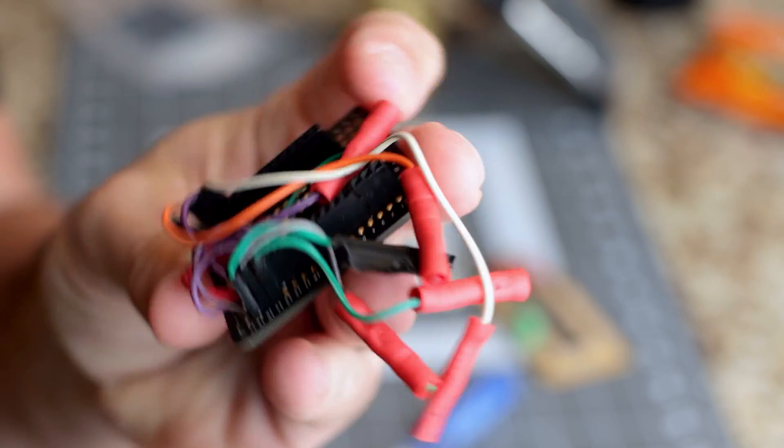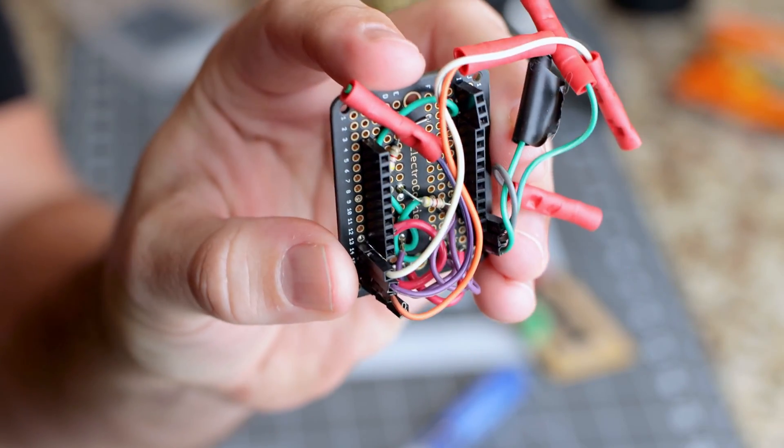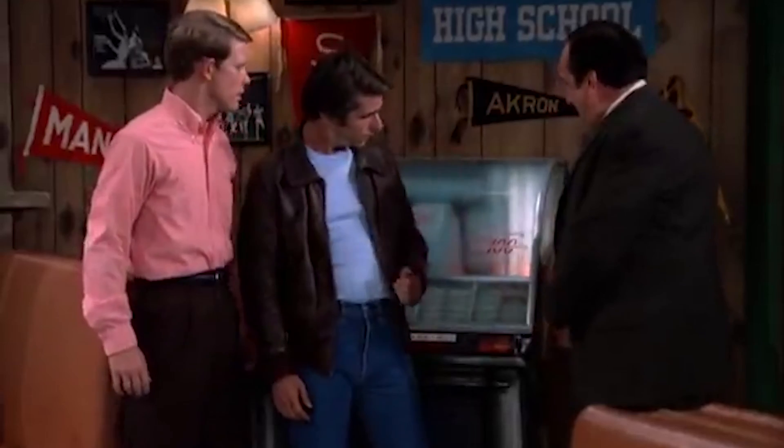One of the problems I've run into is that wiring in a lot of the power LEDs and resistors tends to cause a bit of a mess. This is what it looks like without the PCB — a proto board that turned out really messy because I'm terrible with proto boards and not very good at soldering. It also had a couple of shorts in the circuit, so occasionally when the board warmed up I would lose some of the lights behind my monitor. The only way to fix it was percussive maintenance. You can pick up a five-pack of these PCBs from PCBWay — it comes in a five-pack because that's the minimum, but you can use the extra boards on future projects.